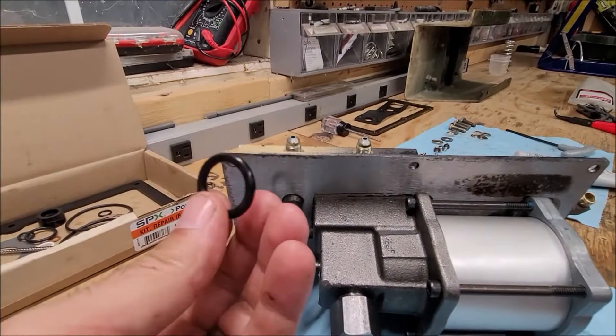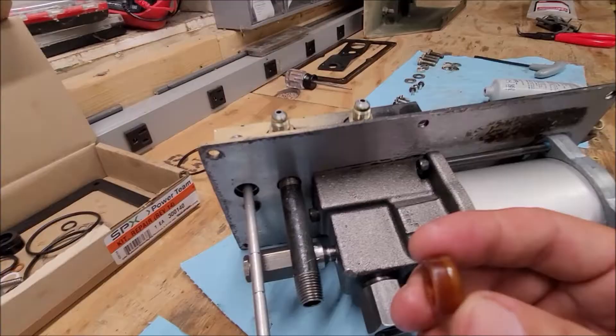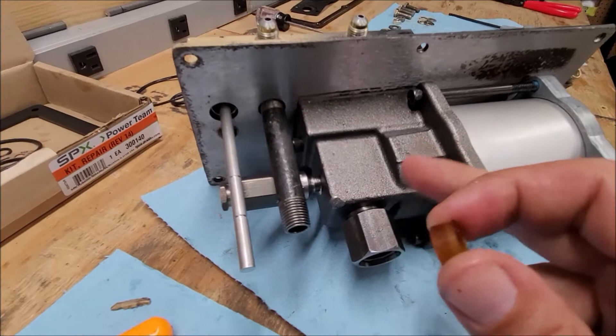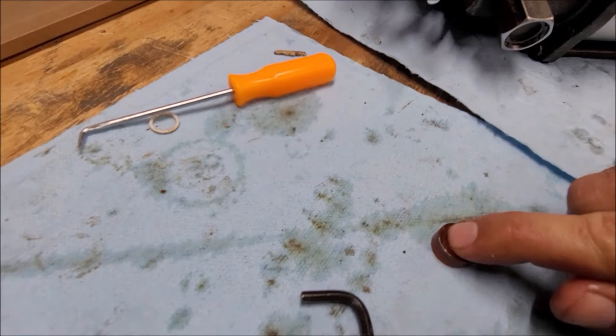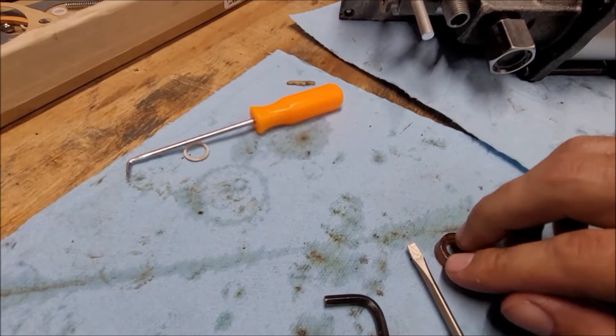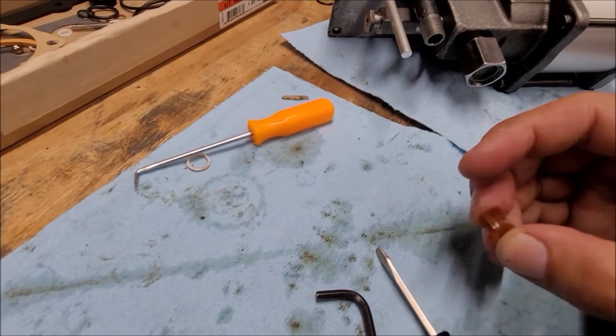There was only one of those gaskets — granted, they can be reused and there's not really anything wrong with them, so that's what I did. One little tip for installing the worn piece that goes into the snap ring: holding pressure with my finger and then using a small flathead to work the edge around to get it to pop into place. The o-ring grease helped.